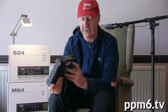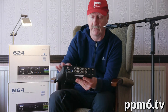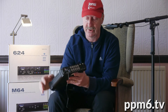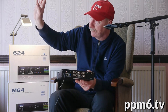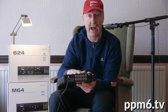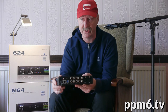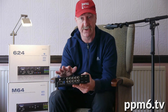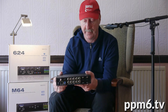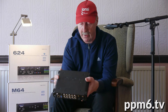But the real beauty is the networking dimension. If I have a second device 100 meters away, I connect the two devices over Ethernet — no switch needed — and then connect this one via USB or Thunderbolt. All of a sudden, all the inputs and outputs on that device are available on this one and vice versa. Inside the web app there's a routing page which allows you to route any inputs and outputs between devices, and because each device has a 48-channel mixer, I can send mixes back and forth. It's also got rudimentary compression and reverb.